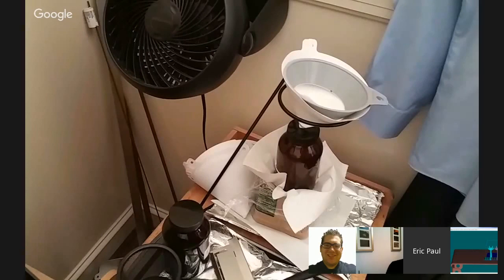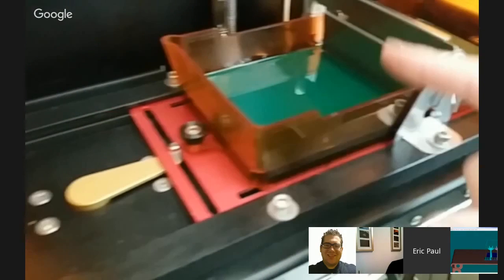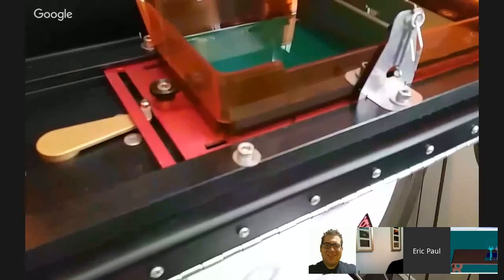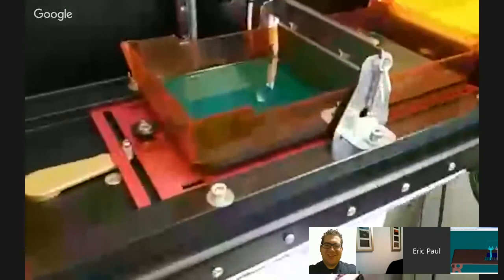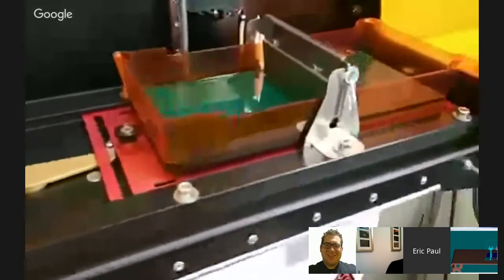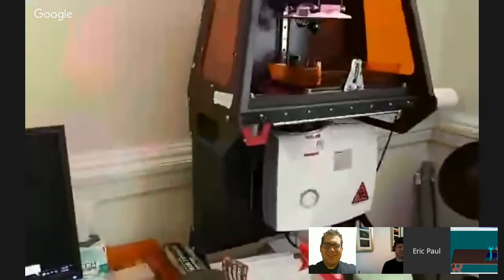Yeah, so if I had a failed print, then because the B9 sweeper takes everything that fails off the PDMS, it'll be deposited over here in this side. So if any time I notice I have a failed print, which is not that often, I'll strain. If I'm changing between resins, I'll give it a strain. Otherwise, with the old cherry, I used to strain it after every job because I did not let the cherry sit in here, all the pigment settled to the bottom, and you cannot stir it in a shallow container like this and get all the pigment mixed in properly. You really need to take it off and I actually have a mag stir that I will stir it on.